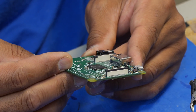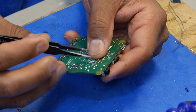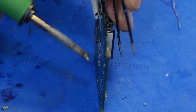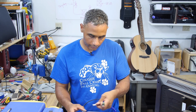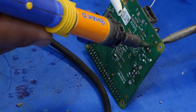Next, I'll try and take this AV plug off. It's going to be a very similar process — it's through-hole, so there are five pins. I'm going to apply some solder, get that flowing, and then come in with the smaller-tipped desoldering iron. There it is — the AV jack is now removed. I'll come back and get the solder out of these holes with the desoldering iron, getting some heat on each side.